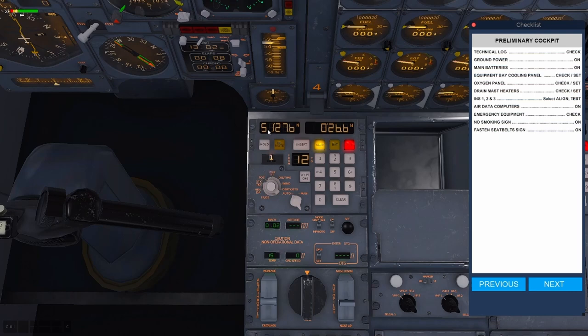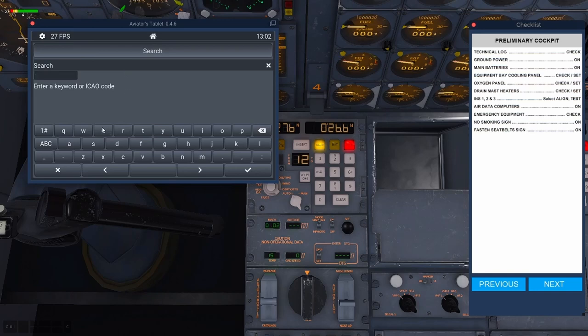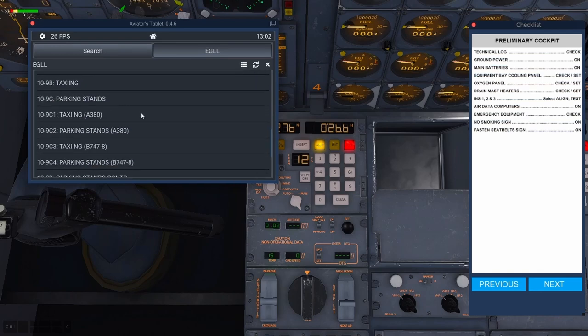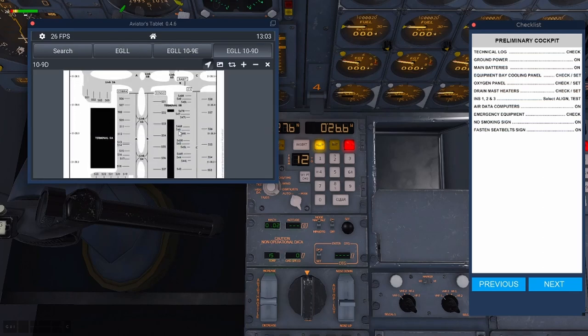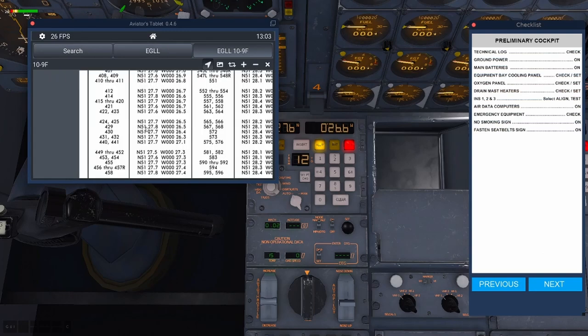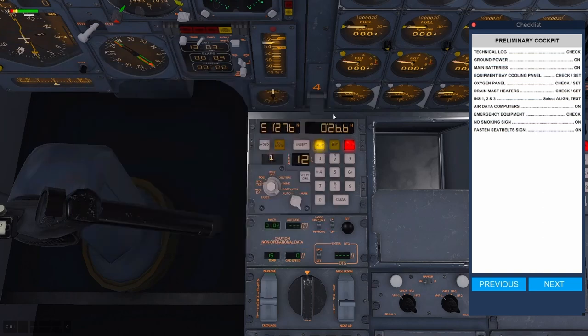We put it to the position page. Through that, we can see it's got an automatic position given to us. If we go on the AVI tab and head to Heathrow — because that's where we are — go to airport, and go to the parking stand coordinates. I'm on stand 419. Looking for it: 415 through 420, stand 419. The coordinates for this stand are shown here: 5127.7 north and 0027.6 or 0.7 west. The aircraft is giving us this — this is the accurate one. Sometimes it can go wrong, so I always make sure I check with the charts.